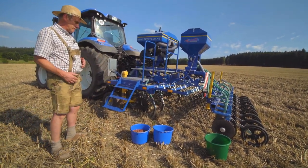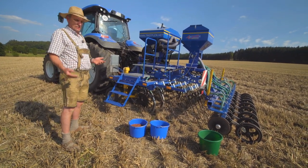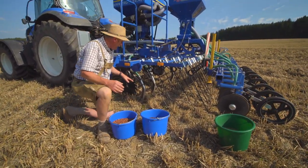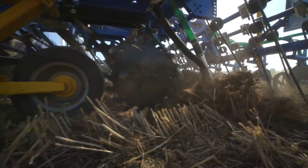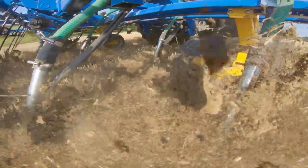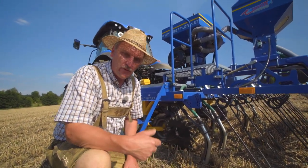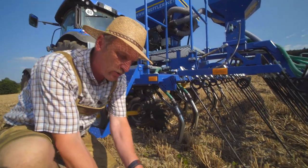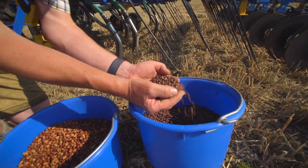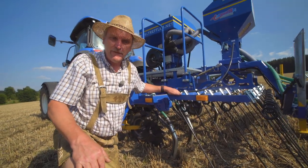Here we are in front of the two-component seeder. This machine was developed because there were problems with simultaneous sowing of coarse-grained and fine-grained seed, which normally don't mix but segregate in the tank. The Treffler sowing machine solves this problem. We can sow coarse-grained crops such as field beans and peas over the first tank using a tine that can be driven five, eight, or ten centimeters deep, no matter how dry the soil is. The seed is placed on firm soil where capillary action comes from below. The sickle coulter cuts into the soil and deposits the grain, covered with virgin soil from three sides so it gets enough moisture to germinate. Both field beans and peas are sown in the front with the tine seeder.